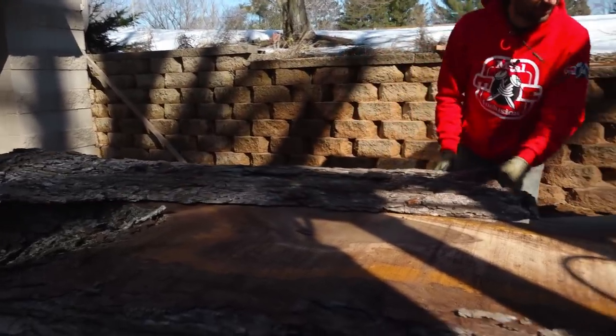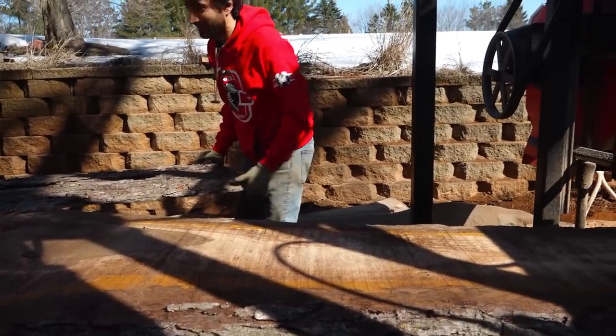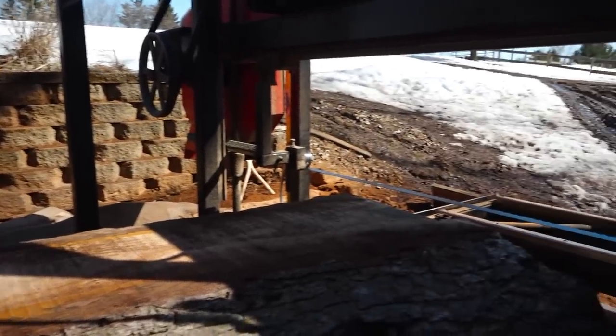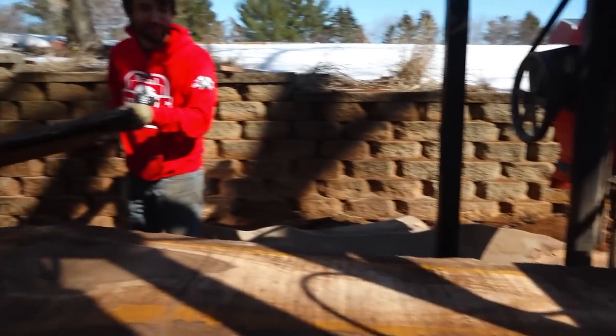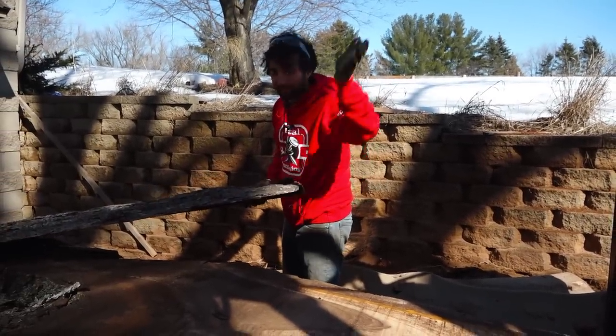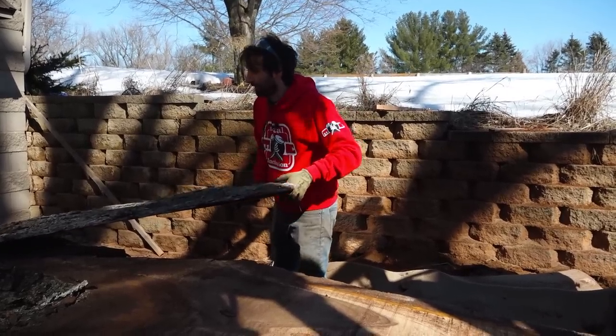So that's basically all sapwood. There's just a little bit of heartwood here, and the rest is sap. I wasn't really expecting anything out of this. Just kind of our first initial facing cut. And I would just keep cutting all the way down to the bed. I'm using the lumber scale today, so very easy to just go and make all your cuts.